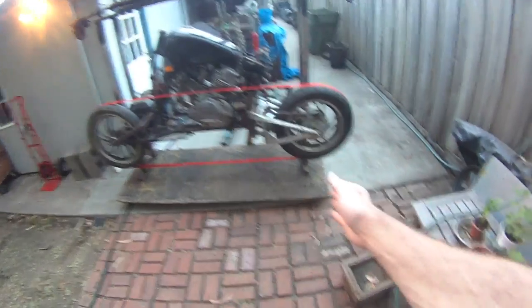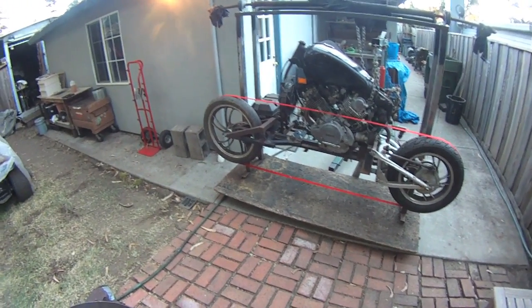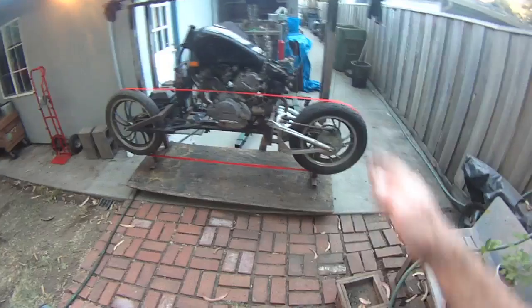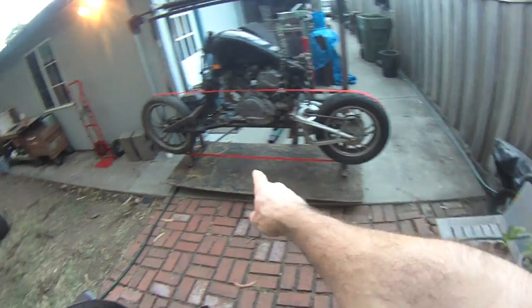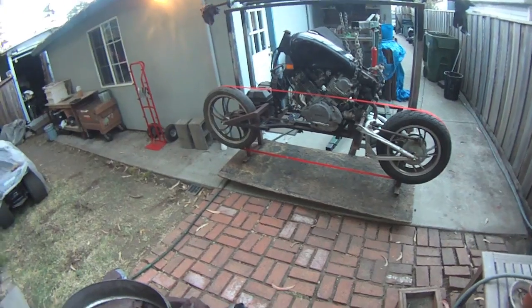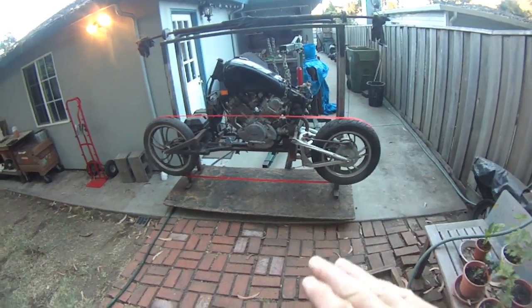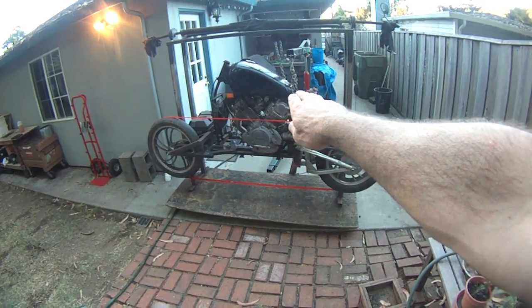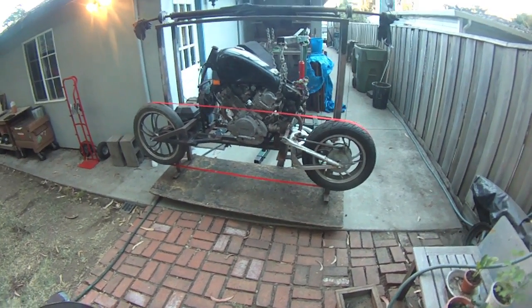There will be wheels on them, and I've built a log bed that's 23 or 24 feet long and 60 inches wide with angle iron. And these runners with the wheels are going to run down the angle iron. You're going to lay the log on the bed, and then this will travel down the log bed, or the trailer, I guess, making a single pass.